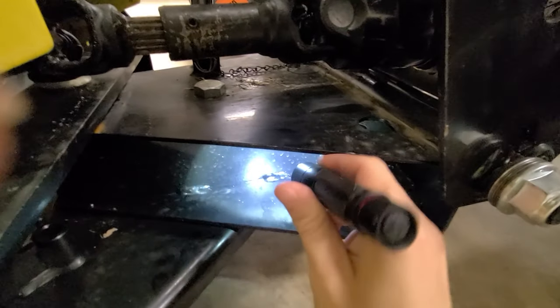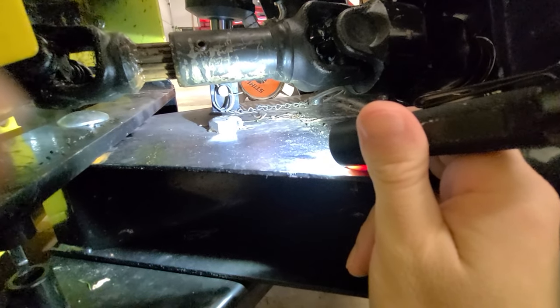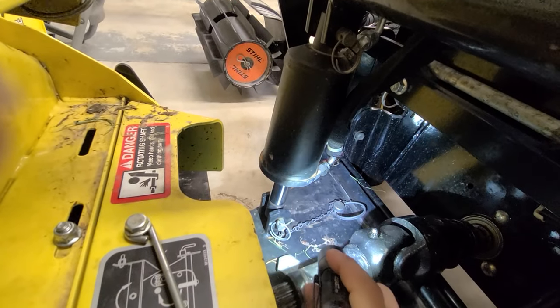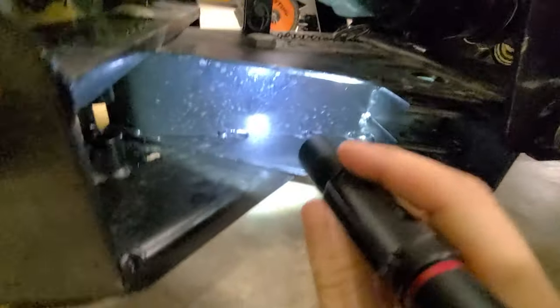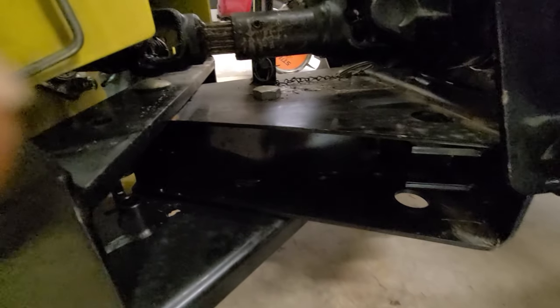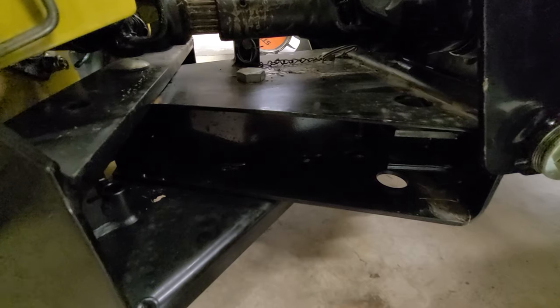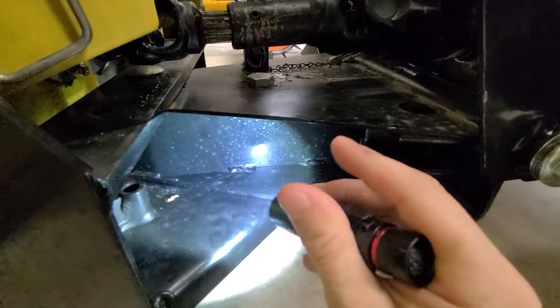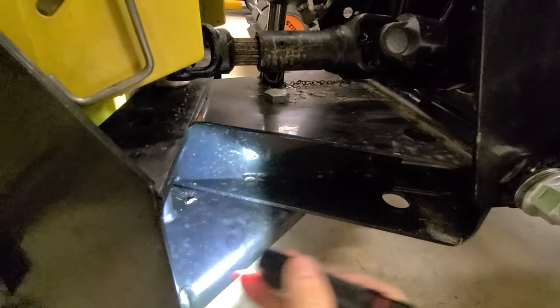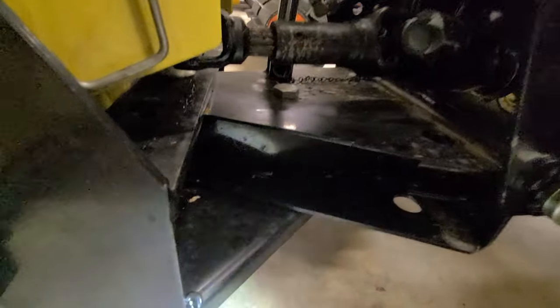See where I'm going here? Next thing I did, see that bolt head right there? That's supposed to be a pin. That pin is right back there in the storage location. Can you see where I'm going here? Guess what I did with that bolt? That's right. 3/4 inch impact and rattled that thing tight. That takes care of the slop out of this A-frame pivot part that's designed for if you wanted to run a snowplow or a broom. I don't plan on running them.